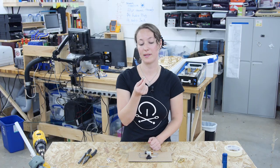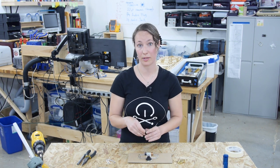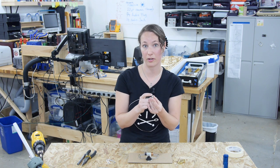If your circuit still doesn't work, take a look at the bulb. Inside the bulb is a filament. If the filament is broken, that turns it into an open circuit because electricity cannot flow across it. Replace the bulb with one where the filament is intact. Lastly, you need to make sure that your light bulb is screwed all the way in. There needs to be a way for electricity to flow into and out of the light bulb. One of those points is the threads on the screw, and the other point is the bottom of the light bulb. Both of those points have to be touching the socket for electricity to be able to flow through the light bulb.